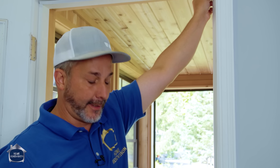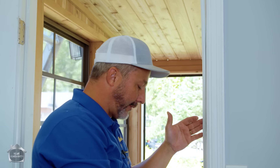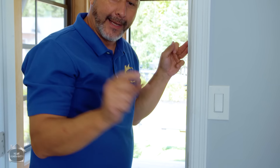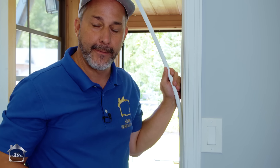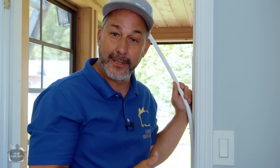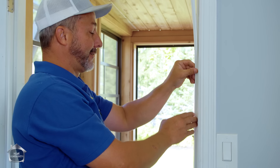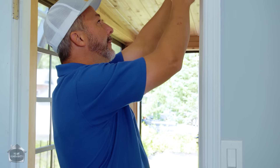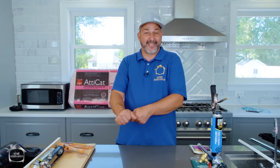Here's a bonus trick: if you're going to paint your door, take the gaskets out first. When you close the door with the deadbolt engaged, it leaves the thickness of the gasket as a gap all around the door so your paint can dry without getting attached to the frame. You can go to sleep while it's drying overnight — you'll probably want to use an oil base, which takes 12 hours.